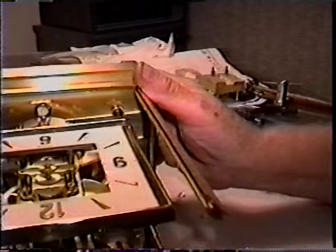Now I'll put my pendulum stand underneath. We'll stand it up. Take the bushing out. There's our wire. I'll take the slot out of this suspension wire. And I'll just drop that pin in there. Put a little bit of down pressure on it. Now I've got it suspended. Take it off the stand. And this is an important part that has to be done. The clearance, I'm going to show you that in a minute.